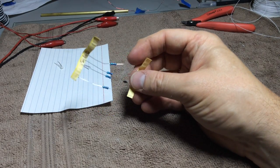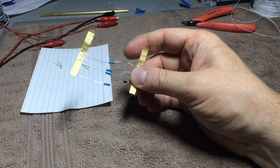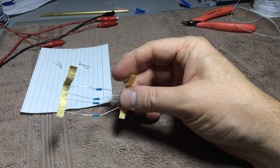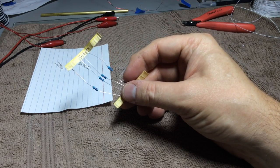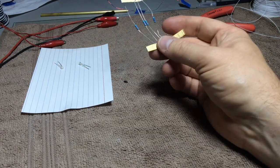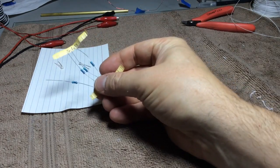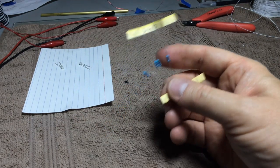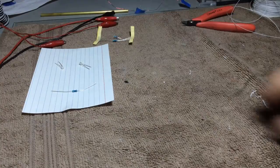If they don't, you should make sure you check it out, and there are formulas depending on your voltage and resistance and the current that's drawn from the LED itself. But generally, if you're working with a 12-volt system, there's sort of two categories, and they're differentiated by their color. The yellow and red ones need a 560 ohm resistor, and everybody else needs a 470. So if you're using a 12-volt system, that's the one to go to. And when I get these, I usually just write up at the top 560 and keep them in my drawer. And then when I'm ready to use them, we get it out, get it ready.